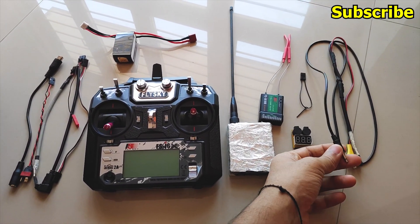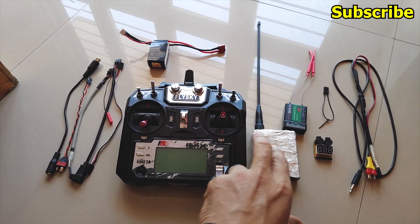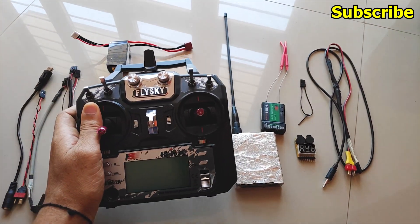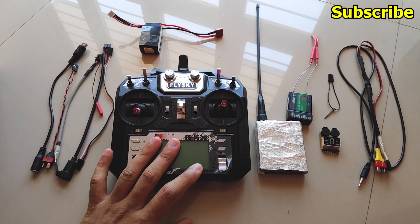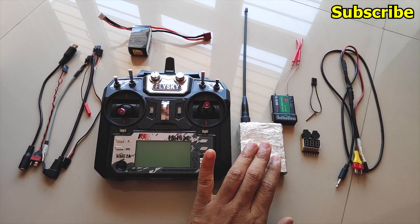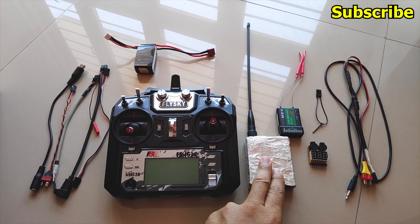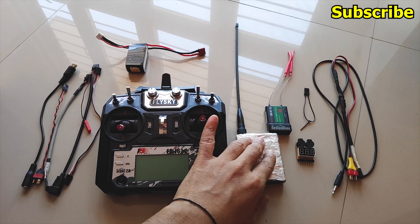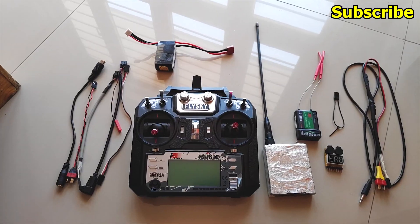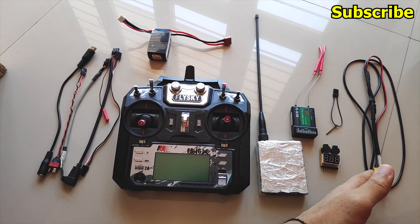Usually when you connect a wire, you are pretty much restricted on how far you can have the UHF transmitter away from your radio — you typically attach it on the back side. But when you use a relay system, you can actually place the UHF transmitter a lot further from your radio, and you can also place it somewhere high to enhance the transmission of the UHF signal so your UHF receiver gets better reception. Plus the setup is a lot cleaner than using wires.